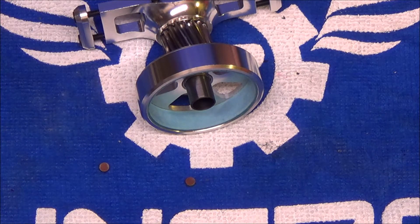Take your Sharpie and color the top of the two exposed sides red, and now you can separate these and know which side needs to be up. So you can mount those magnets in your clutch — either both reds up or both reds down, it doesn't matter. You know you have opposite poles there. Just a quick tip I picked up on the forum years ago. Works great. I love having a Sharpie around — too many things we work with in this hobby are black so black Sharpie tends to blend in. Red sticks out really well.